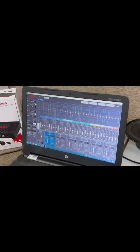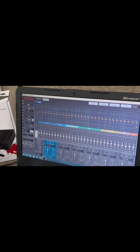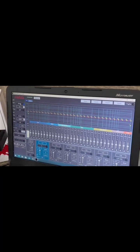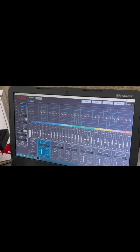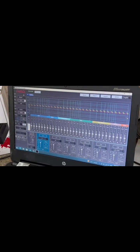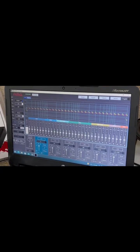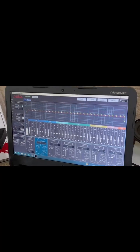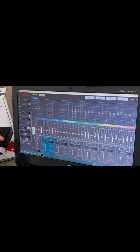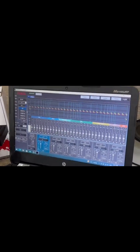On the home screen, you can see there is a high-pass filter. There are three different types of filter settings: Butterworth, Linkwitz, and Bessel — like three different tastes. Most people use Butterworth. Linkwitz is better when you are adding more amplifiers and expanding the system on a bigger scale. The frequency setting depends on each speaker, so you check the speaker's frequency and input accordingly. Slope can be set to different levels from 6 to 24 dB. The same applies to the LPF low-pass filter.